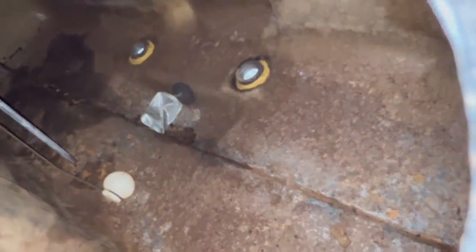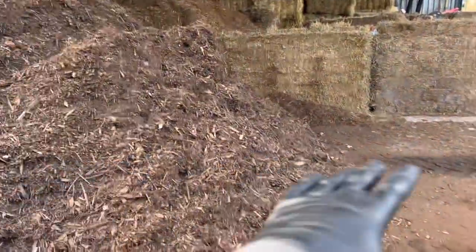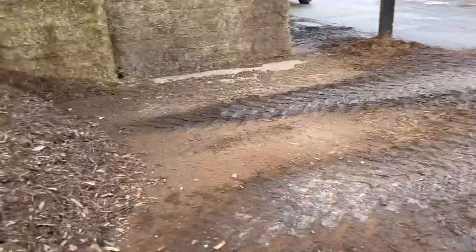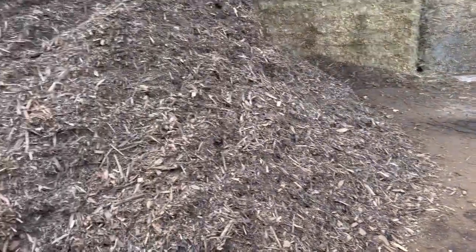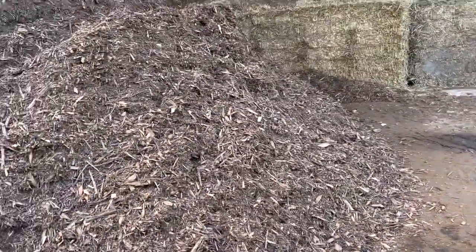The tank's nice and dry now, maybe a little bit damp at the far end. It still looks a bit rusty though, so we need to put something in it and shake it around. That filter's clean. I'm going to shake the tank now with a little bit of diesel in, knock this wood chip down flat. We can tip the diesel out into the wood chip and then it'll just go to the boiler and get burnt, along with all the bits of rust and rubbish in the tank rather than going down a drain somewhere.